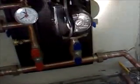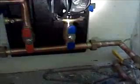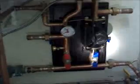So here we are. This is the manifold, and this pump, I'm going to shine a light on it right here. This pump right here is an adjustable Grundfos pump, and all this does is pump water from the boiler to this manifold and back down. So basically it does this. If you see the light going, that's all that's going on with that. This pump pumps the water across the manifold, and basically it's a series loop from here. So we have primary, secondary pumps pumping to the manifold and a series loop system, which basically means all the baseboard is in a single loop in series.